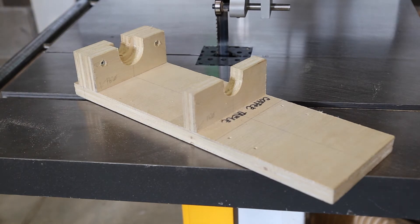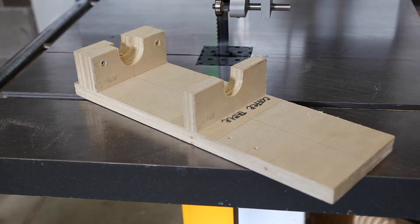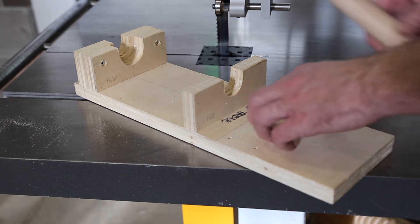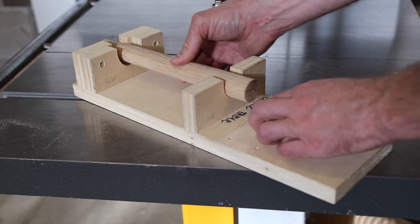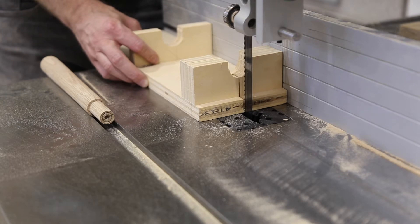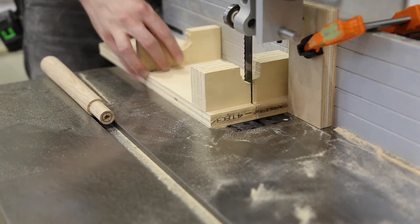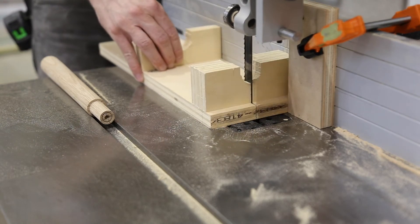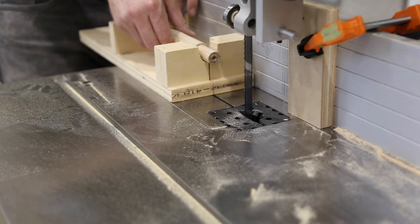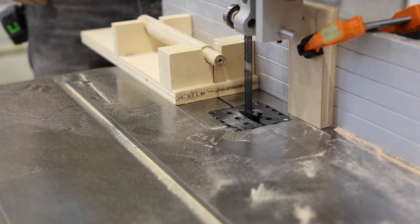So it's just a few more steps to completing our joint. First, I'm going to use this jig to cut a kerf in the tenon that I've just turned. This jig holds your part so that it's parallel to the table surface — it's designed more for a production type scenario so that if you were doing a number of parts, you could do them fairly quickly and efficiently. The part fits in by registering against a stop that hits the shoulder, and then I'm going to set it up so that it runs along the rip fence of the bandsaw. I'll set up a stop on the rip fence so that I don't cut beyond my shoulder, then mount my part in so that the blade is cutting radially through the annual growth rings — this is a measure to prevent the part from splitting when we assemble the joint.